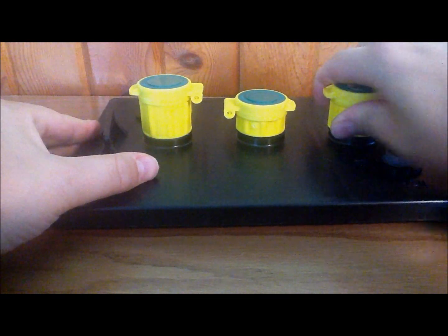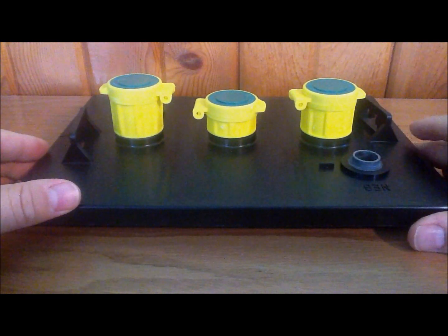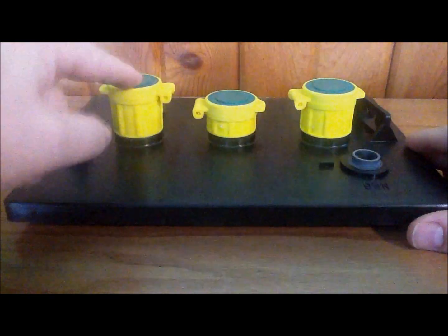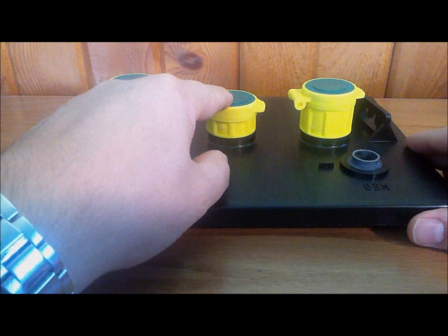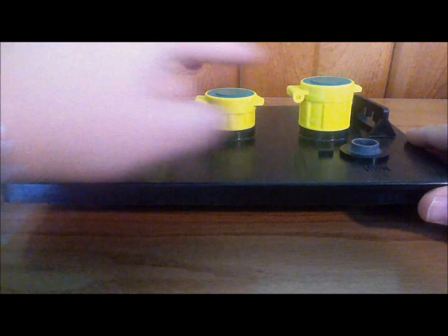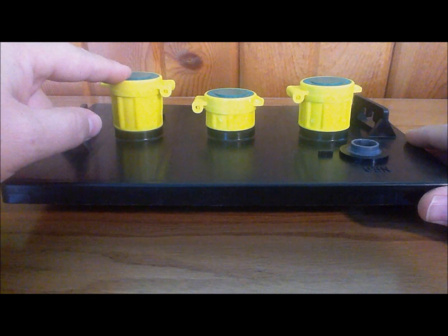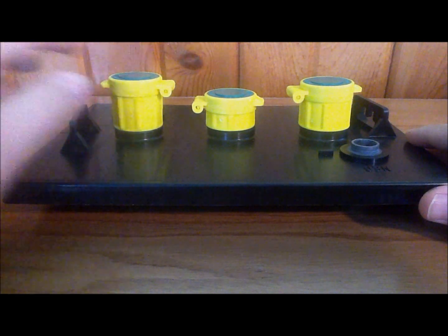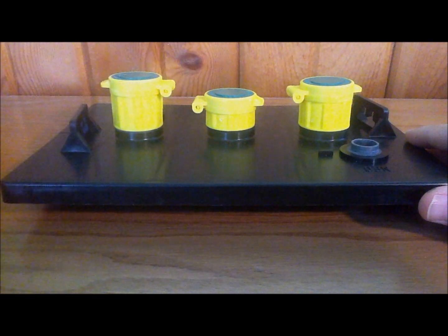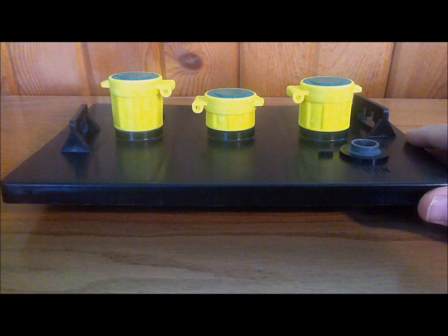So there you go. There's our first video on the different sizes of Watermizer vent cap. Again, the standard size, the medium size, and the extended height. The standard height is most preferably used in industry, in rough environments. The medium height cap is for RV and golf carts. The solar industry oftentimes uses the extended height cap because you get about 10 to 15% more capacity out of this. It's got a larger condensation chamber, and for some reason it helps coalesce and condense more of that electrolyte before it gets out.